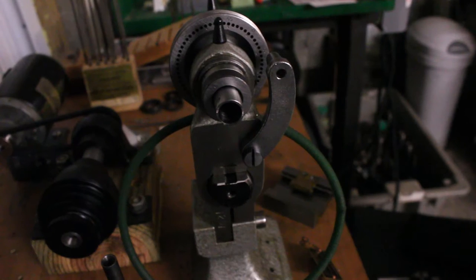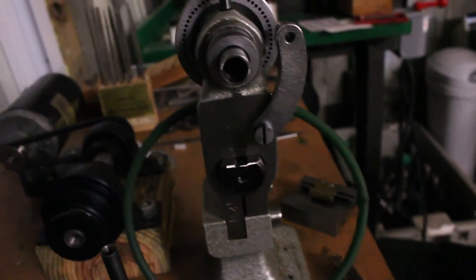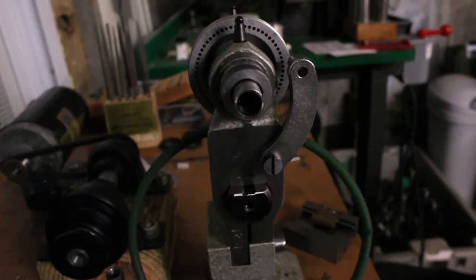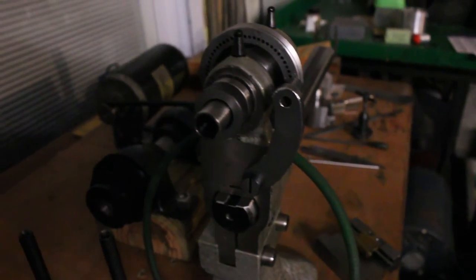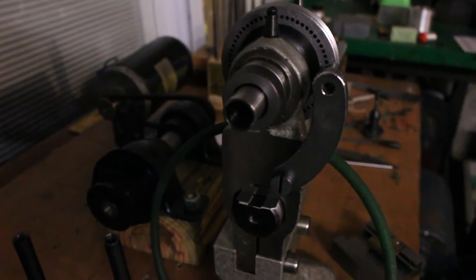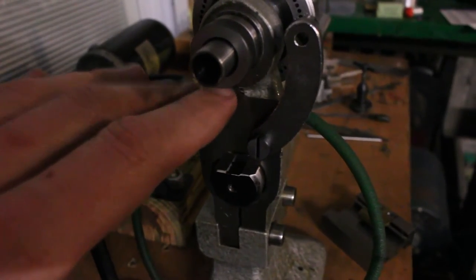Now, in contrast, let's take a look at the little watchmaker's lathe here. And this came from the factory with no provisions whatsoever for thread cutting or mounting a thread cutting attachment. And there's not a lot of room in the headstock design for a slick arrangement like the Hjorth has, with tumble reverse and an output stud coming out of the headstock.